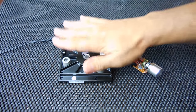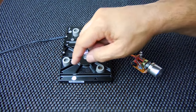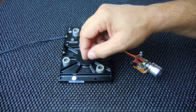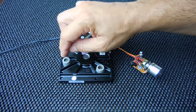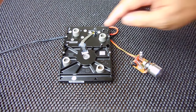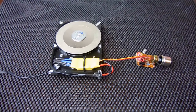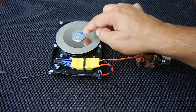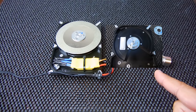You want nothing left. On this side you can see that I screwed in rubber feet to have a nice base for this diamond grinder. I found areas where there was nothing in the way, drilled holes, and then using a tap I tapped the holes so I'd be able to screw these rubber pieces down securely. On the back of the hard drive when the circuit board is removed, you're only going to have three terminals going to the motor. Once everything's been disassembled, all you're going to have is the aluminum body with just the motor in the middle.